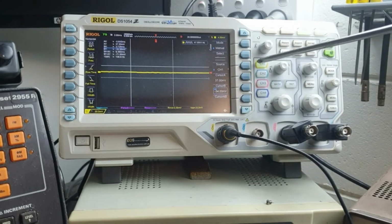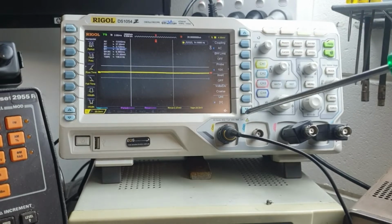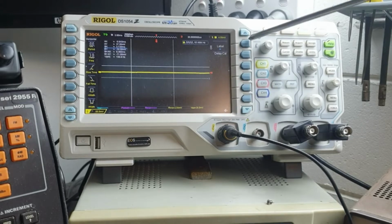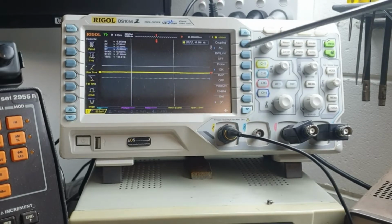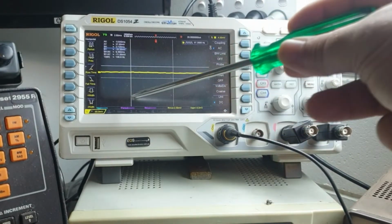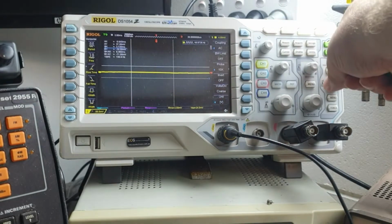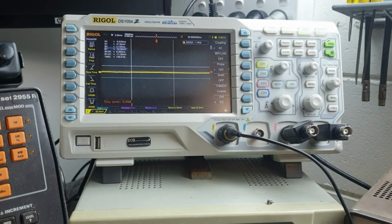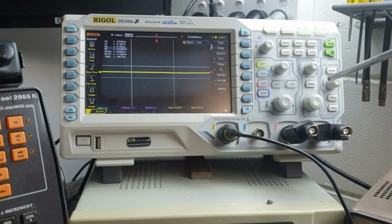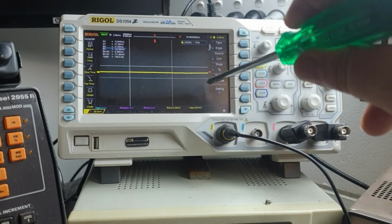Just using channel one set to AC, by 10s on the probe, just so that the probes don't add too much impedance into the system. Just a pretty simple setup there. Measuring volts peak to peak down here, 50 millivolts centered, and I just put the trigger above the zero there. So it's triggering on, let's pull the trigger quickly, edge trigger, channel one on the downslope,